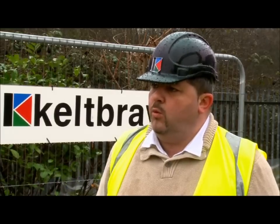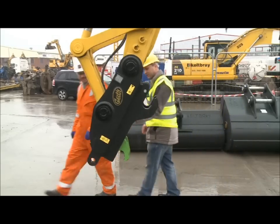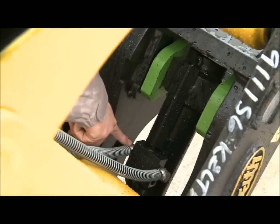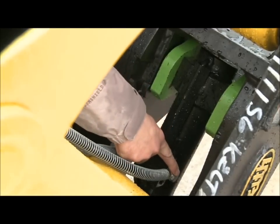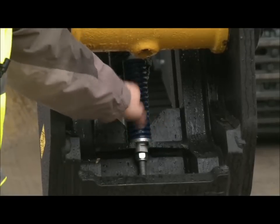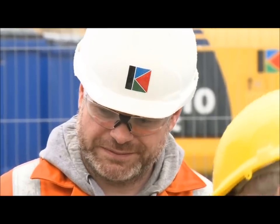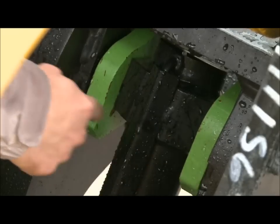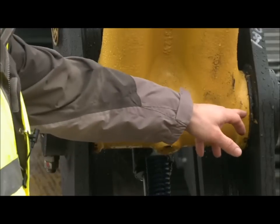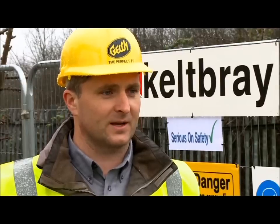What are we doing on the weekly check? We recommend removing an attachment, fully hosing down the coupler, making sure everything is clear and clean so you can get a good clear inspection on all the engaging parts and the highly loaded areas of the coupler. Check for wear, check for cracks — it's a tough business, demolition. Working with breakers is very hard on the machine, not just the coupler, so we recommend checking it thoroughly for cracks and excessive wear.